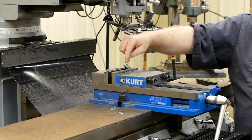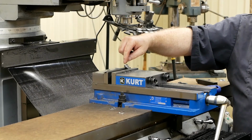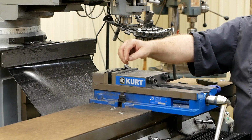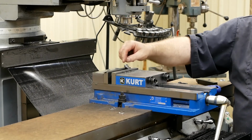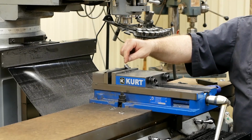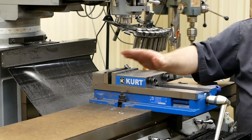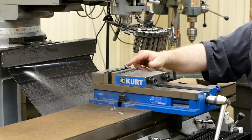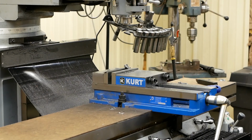By taking an end mill, a 3/16 diameter, which is going to be the diameter of our cutting tool that we're going to put in there, by going down in there and spot facing that, I can take the part that's protruding up on the angle, I can make it so it's already at a 3/16. Now when I take a smaller center drill and go through there and ream it, I won't have to worry about deflection on the tool. So Adam's gonna get a picture of that so you can see exactly what we've done.